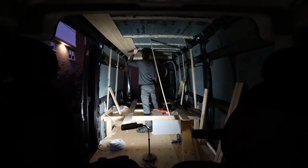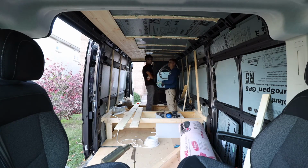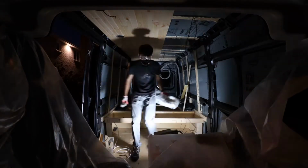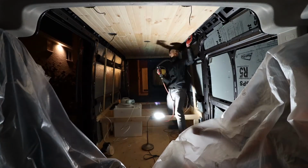And this material being about 1/2 inch or 5/8 inch thick, it was easy to install piece by piece rather than just one large sheet. We also thought about just using a large 1/4 inch sheet and just nail gunning that to the wall. However, 1/4 inch material isn't rigid enough for the wall if you're going to end up leaning on it, and 1/2 inch plywood as a large sheet would be too big and heavy to install.